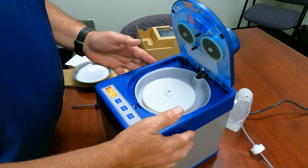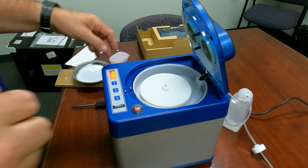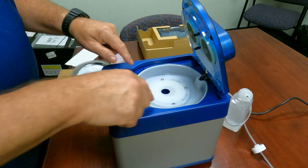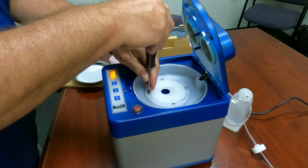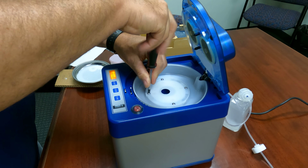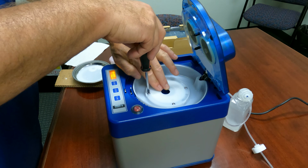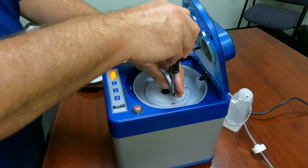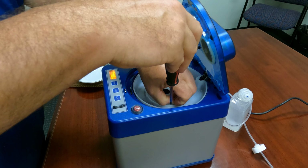and you will want to remove the plate and table, and you'll see 4 Phillips screws. Go ahead and remove those screws, being careful not to drop them down inside. You may want to even put a piece of tape over that to prevent yourself from dropping them down inside, as I almost just did. Go ahead and remove each screw.